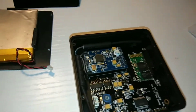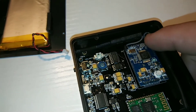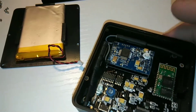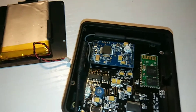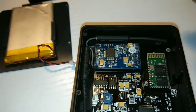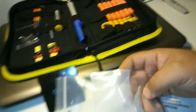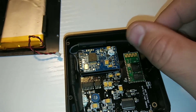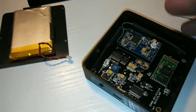So what I'm going to be doing today is I'm only going to be soldering one antenna. Unfortunately, this board is soldered to the other board here, so I can only access the solder joints on this one antenna right here. This appears to be some form of diversity box — two different antennas, whichever one's picking up the best signal, it's going to go with. Because I can access the solder joint on the side of this one, we're going to go ahead and solder in this brand new 3dBi big boy antenna that's larger than the G-Box. I'm going to do a hole right there at the bottom where the other antenna is, stick that SMA jack through it so it pokes out the bottom, screw on the nut, and then we'll be able to fit that big antenna on there and see if we get a range increase.